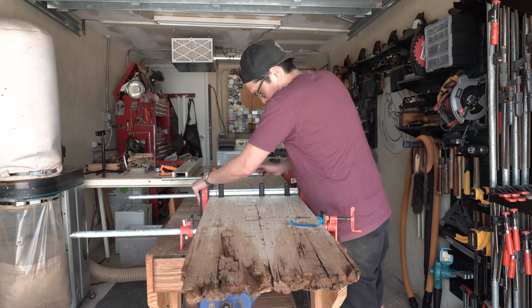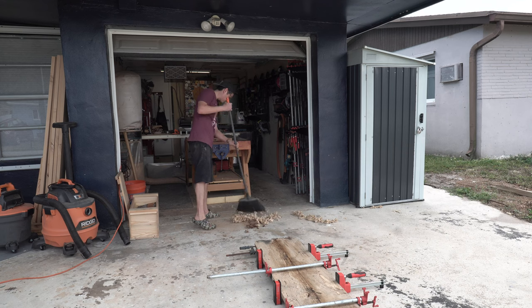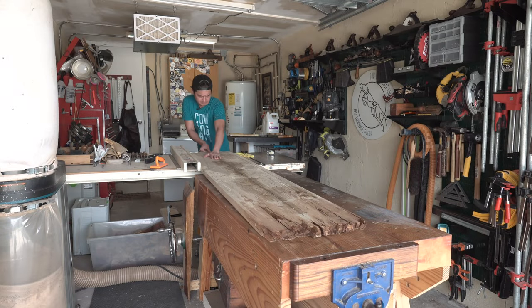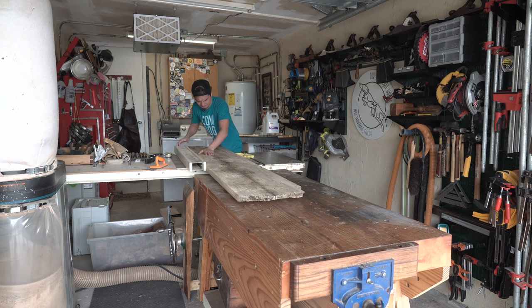Anyhow, the other benefit of epoxy was that it allowed me to really take my time and make sure I had all my clamps in place and not worry about fast cure times, especially in this sweltering South Florida heat. Also, there were plenty of punky spots in this black limba, so I felt that using epoxy would also help stabilize any soft spots along the seam.